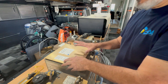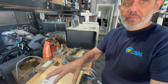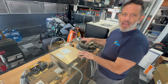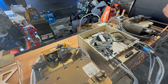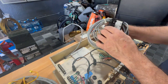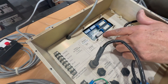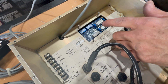The customer dropped off his processor and his starboard actuator, and this is my test bench port side actuator. He's having issues with a feedback alarm that is on the starboard side. You normally would take off the cover, put this to the side — this is your calibration cable, we'll go over that in a bit. And underneath here is your indicator lights, your dip switches for push or pull, number of control heads and your programming.